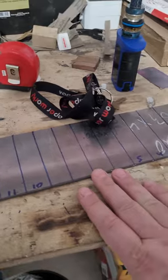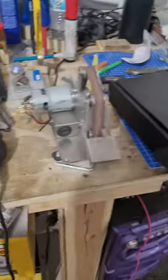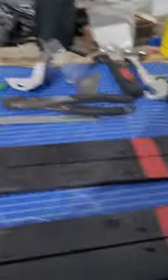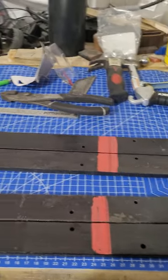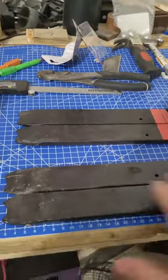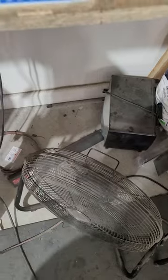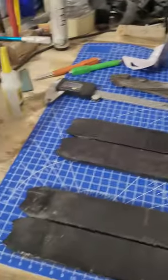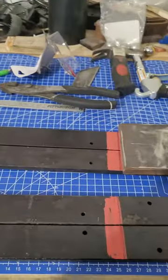I'm going to throw a nice billet — I got the 15N20 nickel compound and I'm going to match it up with 1095 once again and see what we get. I'm also working on these fence spikes and I'm going to use them to match up with these dies and make a whole new die set to have square. And I got my angle iron down there — you see it below the fan — and that's going to be used for when I do canisters to make sure it's all squared up.